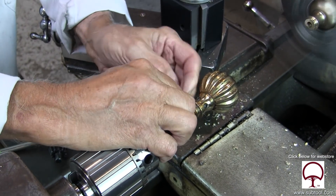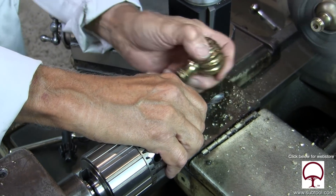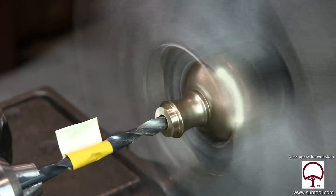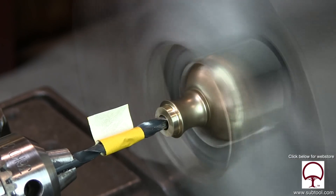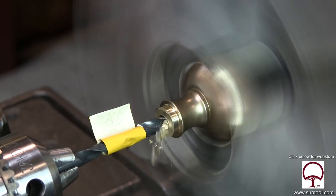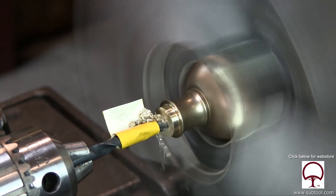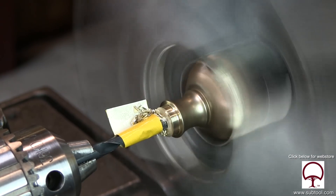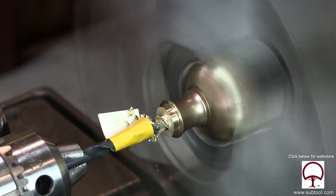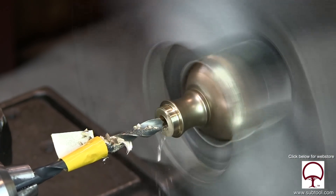That kind of gave us an idea. I just grabbed a piece of tape that we had left over from that double-sided tape, so it's not on there very good, but I didn't care — I just wanted to get a rough idea. Now, if I was going to run all 30 or 40 of them, I'd be a little more cautious and use tape that would stay a little better. But to do a second knob, I'm good with it. I like the chips — the chips are good and we're not generating too much heat. So that's a good thing.